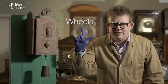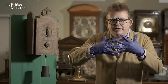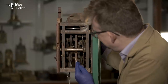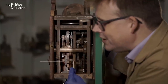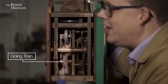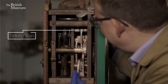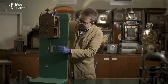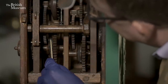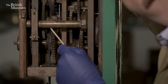Our second element: wheels. Wheels are what we horologists like to call gears — most people call them gears or cogs — but what we're really referring to are wheels with teeth on, so that one wheel can drive another with no slippage and can drive the next wheel very precisely. We actually have two mechanisms in this clock. On this side of this central bar we have what's called the going train, which is responsible for the timekeeping of the clock — every clock and mechanical watch has a going train. And on the right hand side here we have the striking train, which is the mechanism for sounding the bell. Let's talk about the going train first, the timekeeping side of things. That weight is pulling down on this cord and trying to drive this pulley round, and that wheel there is in fact moving very slowly — we can't see it — but the wheel it's meshing with, our second wheel in the train, you can see moving.